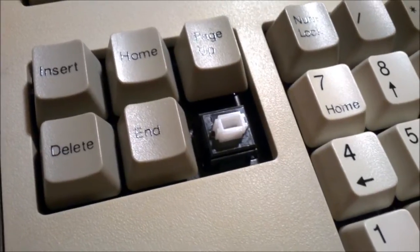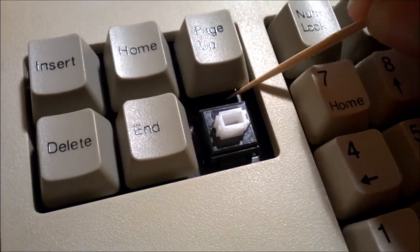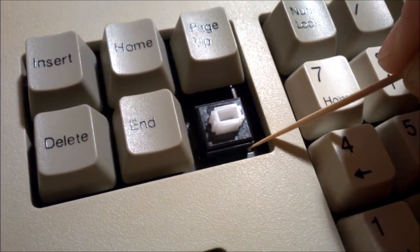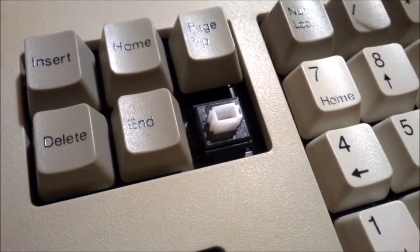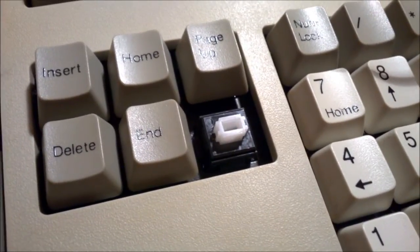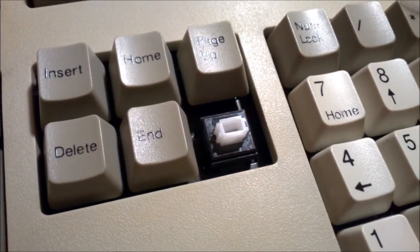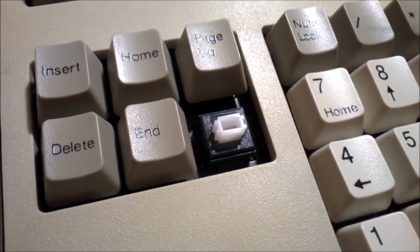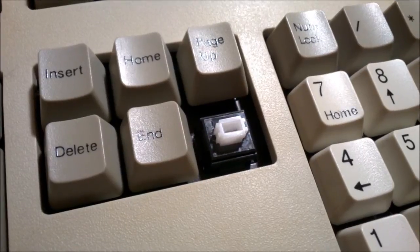You can see two tabs: one at the bottom and one at the top. The tabs clip behind retainers here and on the other side, and that's what keeps the top part of the shell in place. These ALPS switches were designed so that you can take the top part of the shell off without de-soldering the switches — that's very clever and is what allows you to do maintenance on them fairly easily.